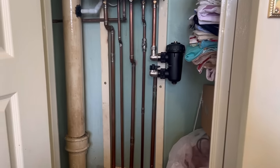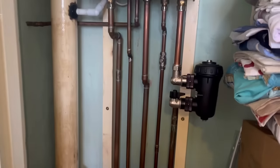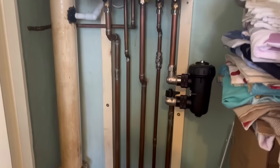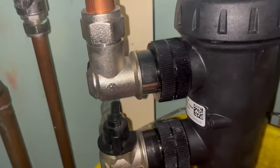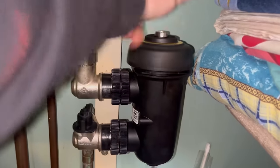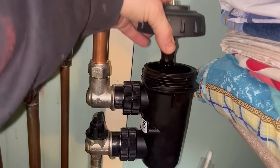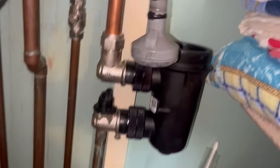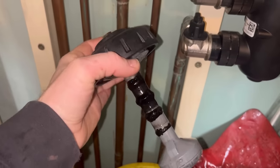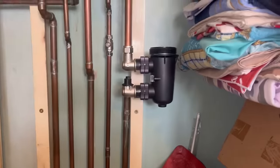Let's get that filter drained. I think what we'll do is put a drain-off on the flow because we want to do a mains flush afterwards. Just isolate these two valves on the wall - there's a little cap on the bottom of these. You can try it off and see the water - it ain't looking too good. Let's take the filter out. The water is jet black, so yeah, we need it clean.